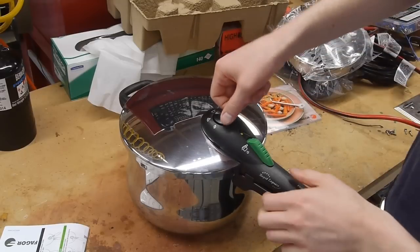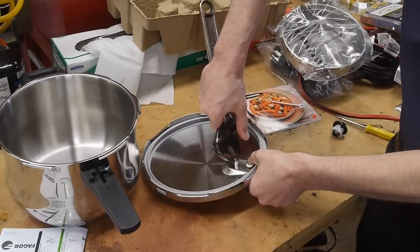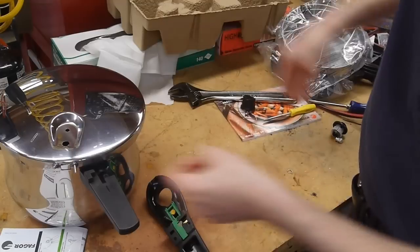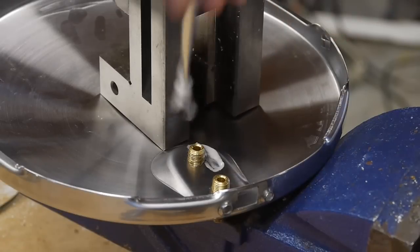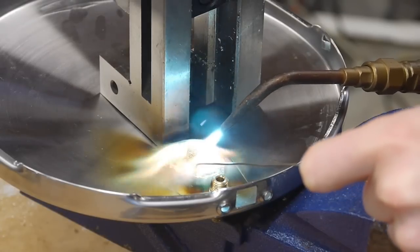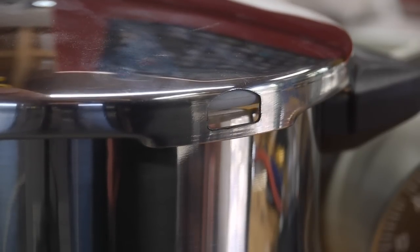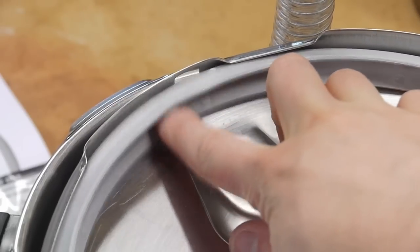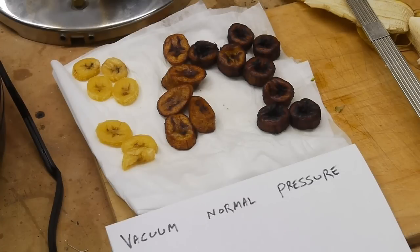Here's how I did it. I started with a commercial stainless steel pressure cooker from Bed Bath & Beyond. I removed the handle from the lid and all of the safety features, and noticed it had two holes already drilled for the pressure relief valve and the normal relief valve. I loosely screwed in a couple of eighth-inch brass pipe fittings and silver soldered them on the other side. I connected the chamber to my vacuum pump, pumped it down, and then realized I had a problem: the seal that comes with this pressure cooker is meant to be inflated by pressure. So if you try to pull a vacuum, the seal pulls itself in and breaks the seal.